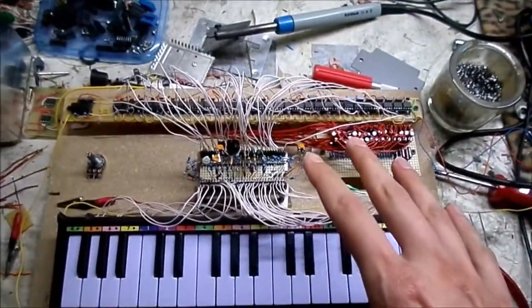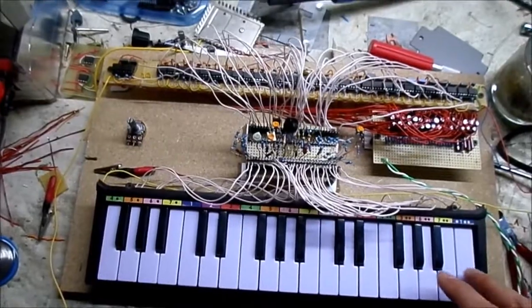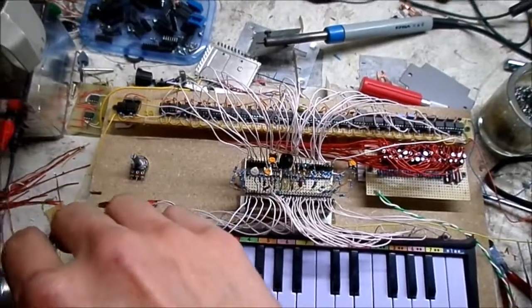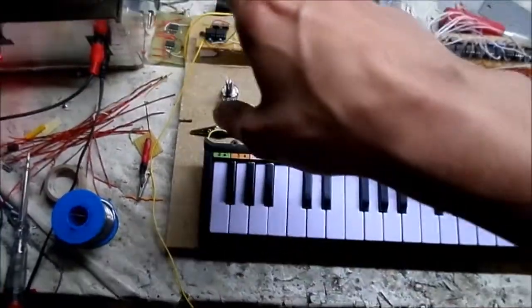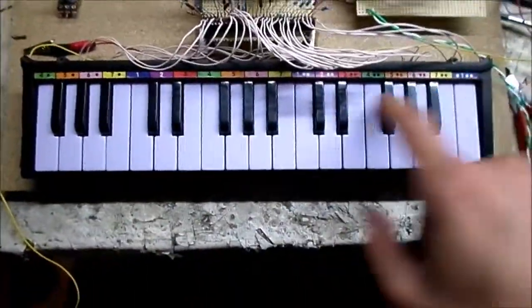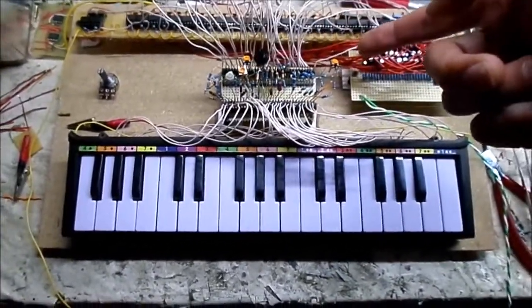555s are relatively easy to work with — easy as hell, really. It kind of depends on what you're wanting to do. In my case I wanted 32 individual tones, so I built up 32 individual oscillator circuits and they're all in astable mode, with the key being in between pin 7 and the positive rail. Inside here is a positive bus rail, and each of the keys comes into this header strip, which goes into this network of transistors — each key gets its own transistor.